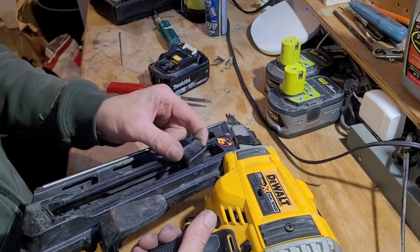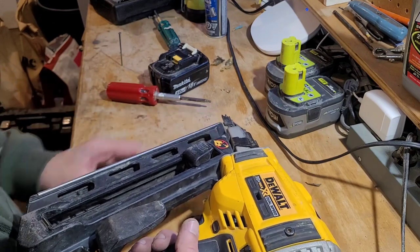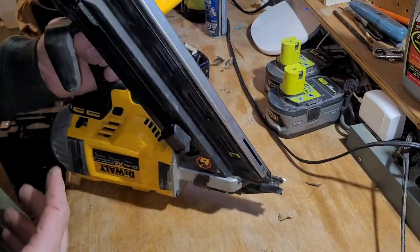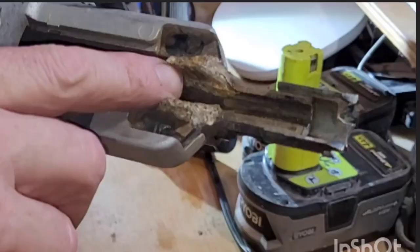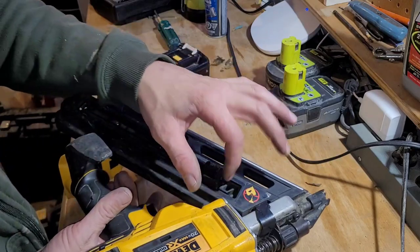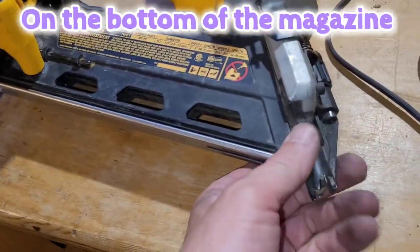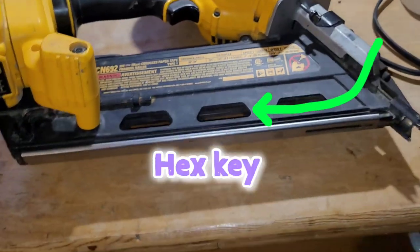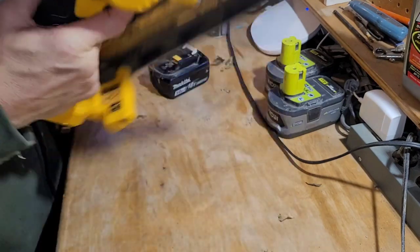She's all back together. I took the whole thing apart, cleaned up some of the parts — it looked a little bit dirty — put it back together. That didn't work. But I started digging further and I took this magazine off, and that's where all that paper was built up, from using the soggy nails. The soggy paper on the nails. This bolt right here, and there's two at the front — one here and one on the other side — and then that magazine will just pop right off. Anyway, let's try it out, see if it actually does work.